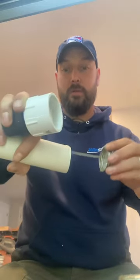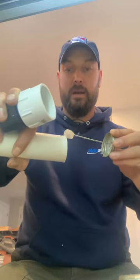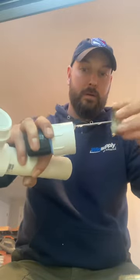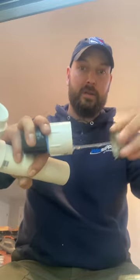The trick is to make sure it's stirred well — thin coats. Pass it six, eight, nine times, whatever. What it's doing here: you don't want it to pool up heavy. You don't need a ton of material on there, but you do want the solvent to do its thing, and I'll show you.